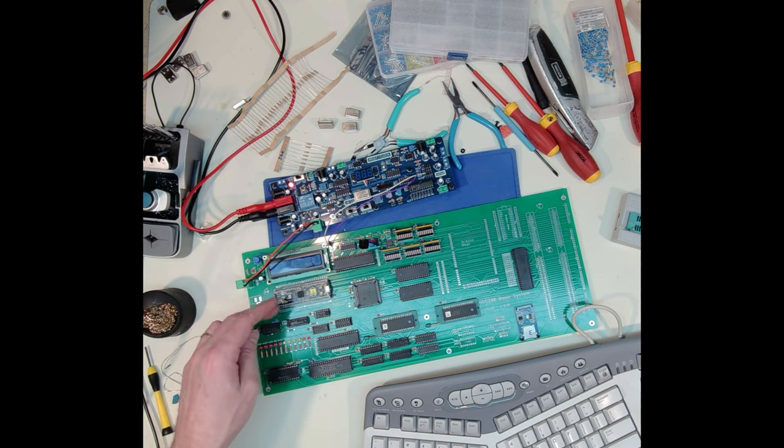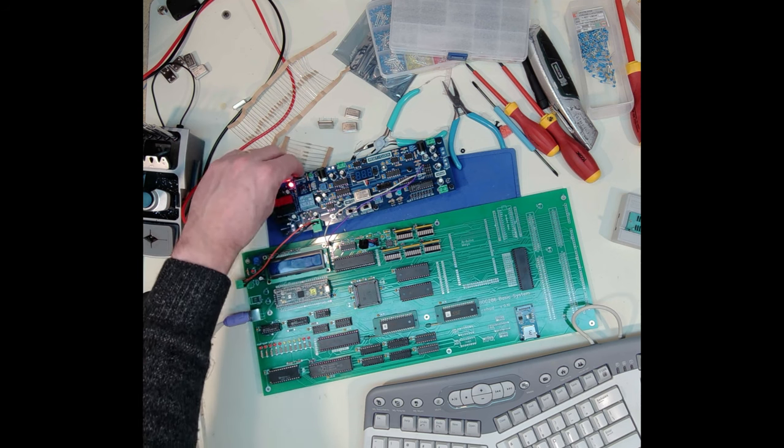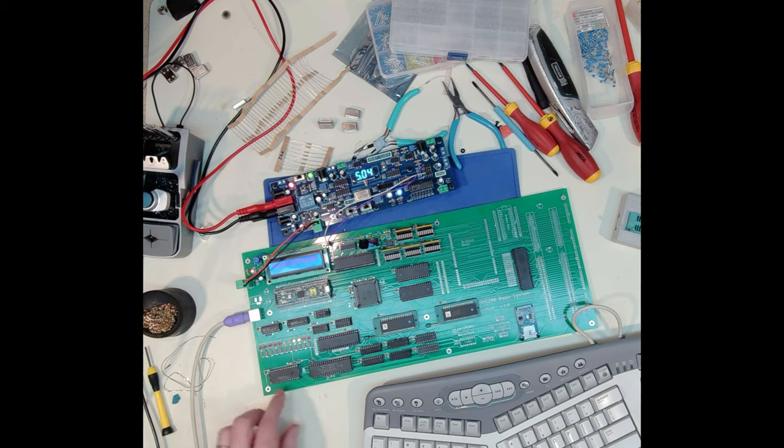And also, I don't have any latching or transceivers or anything that would go between the PSoC and the LEDs. It's just directly driving them. And I have a really small 3.3K resistor that is here, so it's not pulling a lot of current. These are pretty dim LEDs, but that's intentional. I didn't want it to annoy me. Hello world, that is working.